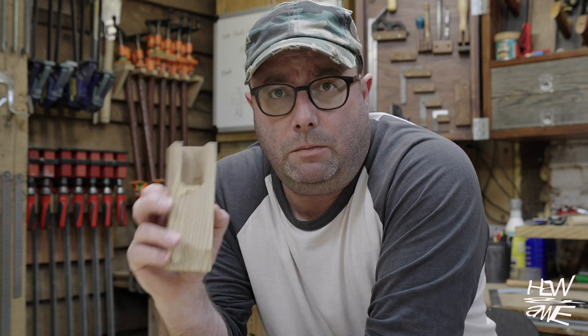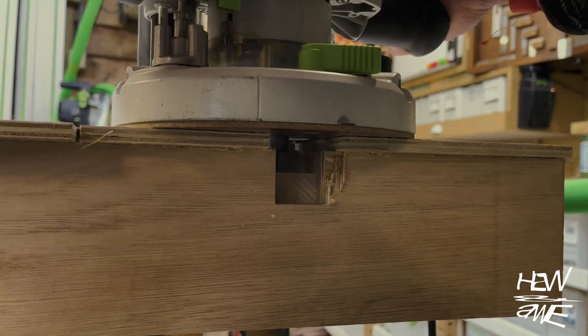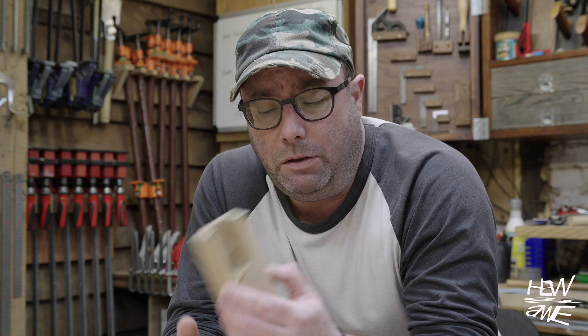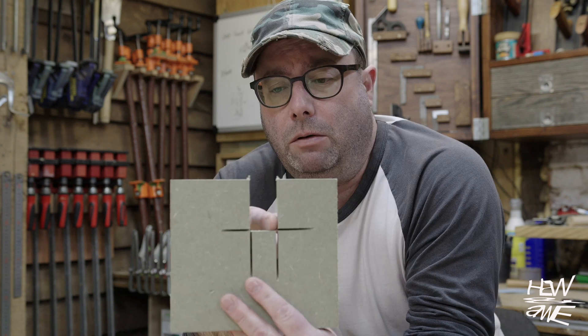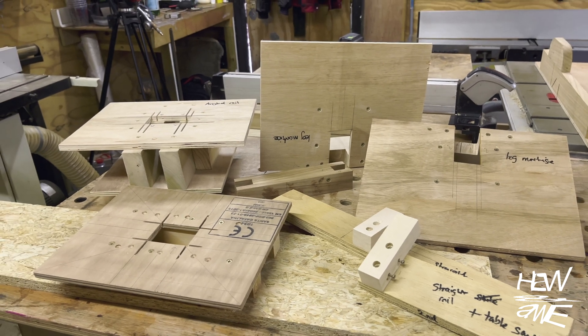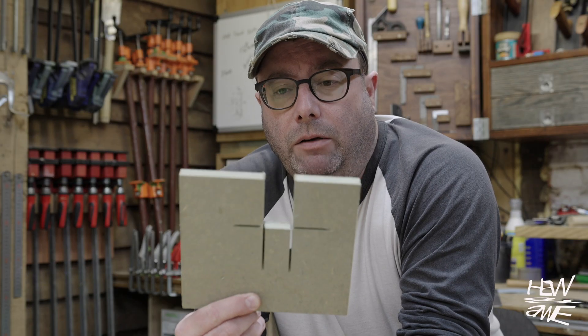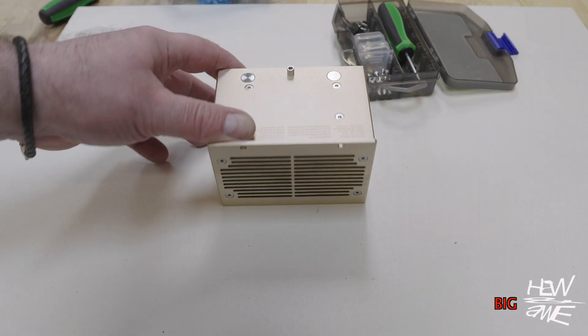To give you an example — this is the top of a table leg and I'd need this mortise cut out, so I'd need to make a template for that. I don't have a mortising machine, and besides, the apron would be raised up higher, so I'd finish off those corners with a chisel. I'd use a guide bush and a router bit to cut that out. Getting those completely dialed in to exactly the measurement you want within 0.2mm, you can burn through a lot of stock trying to get it right — so I'm hoping the laser is going to fix that problem.